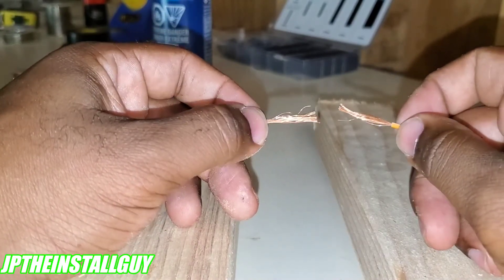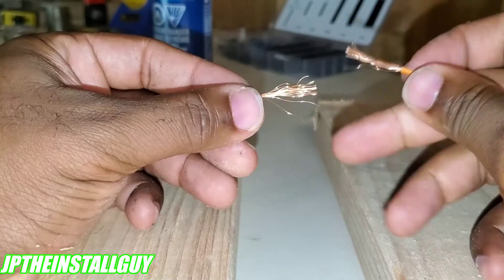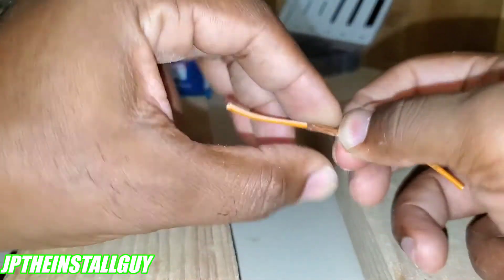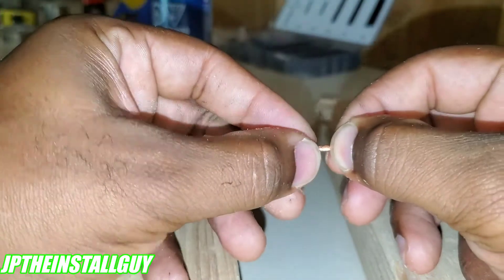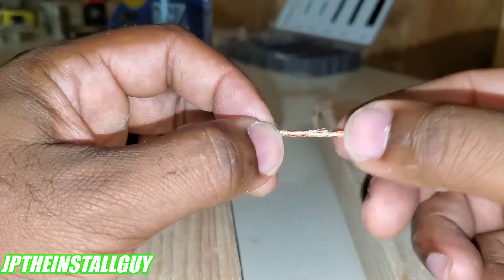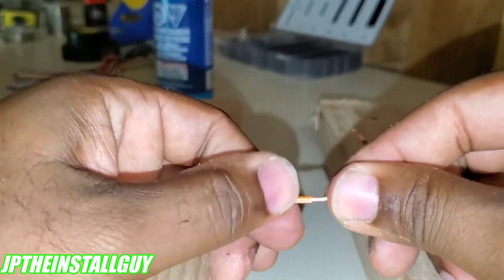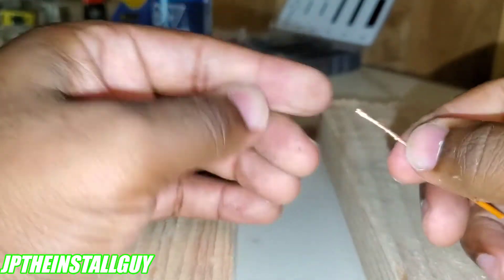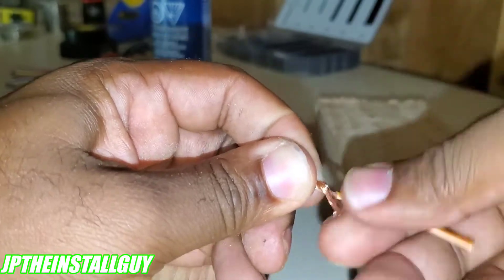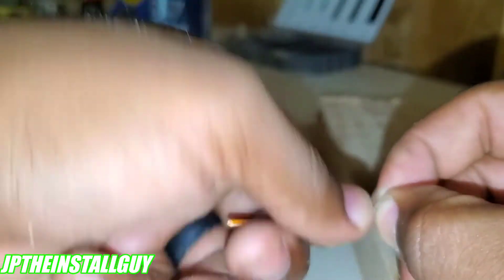There are a couple different ways to get your wires ready and prepped for soldering. When you strip your wire back, you'll kind of unravel and untwist them a little bit, then join them together. After that, grab both ends and twist — I'll hold with my right and twist with my left, then vice versa. Sometimes when you join them that way the wire can poke and pierce your skin, which is irritating. My favorite way: strip the wire, twist the ends together individually to make an X, then twist that wire around — you still need to be careful not to poke yourself, but it's just easier. Strip back about a little over a quarter inch, almost half an inch.